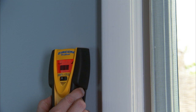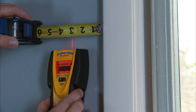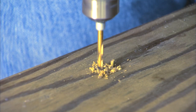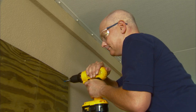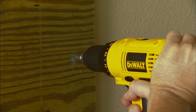For stucco homes with stud framing, find the stud center on the interior, measure from the edge of the window, and transfer that measurement to the exterior to locate the stud. Drill holes at all of your marks, then hold the plywood in place and drill through it in the top corners. Drive screws into those holes, then drill into the rest of the holes and drive the remaining screws.